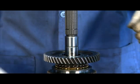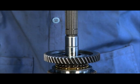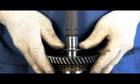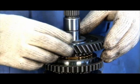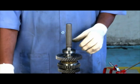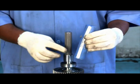Match the groove on the shaft and collar bush, then insert the collar bush into the shaft. Insert the 2.5mm ball, insert the bearing, insert the spacer bush, and use a special tool to press the bearing into the shaft.